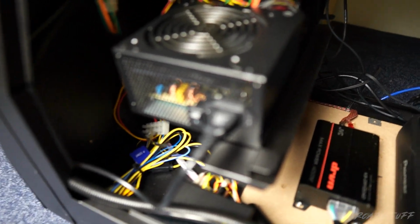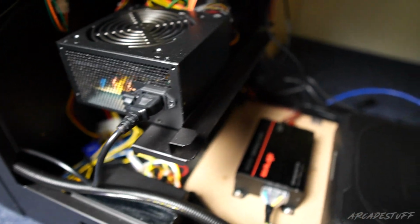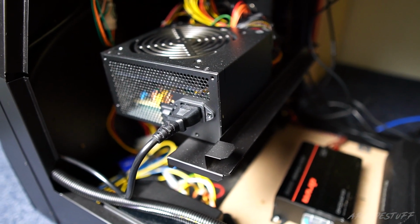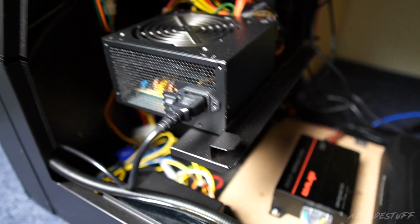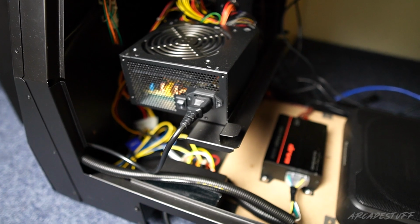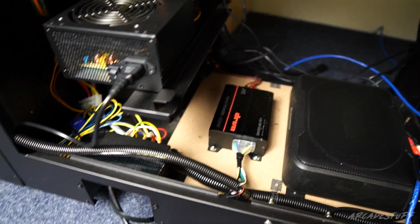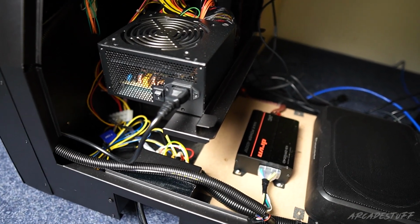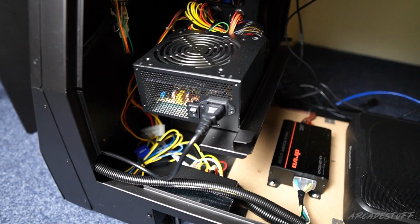So you'll see that I've got a power supply here. I did replace the power supply in the cabinet with a PC power supply. This power supply only really supplies 5 volts and 12 volts to the I/O board and to the coin mech. That's all it does, because everything else is independently powered in this cabinet, and I'm not running game boards off it or anything like that, so a PC power supply is fine. The power supply that came in this cabinet was kind of dodgy and I didn't really want to use it, so I just got a high quality PC power supply, and I'm pretty confident that that will be able to power everything fine. And the fan in this power supply is much quieter than the fan in the original power supply.